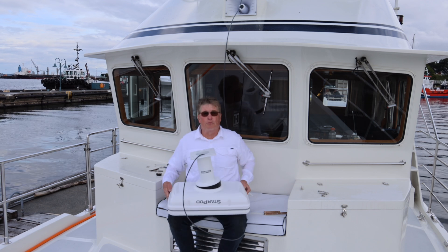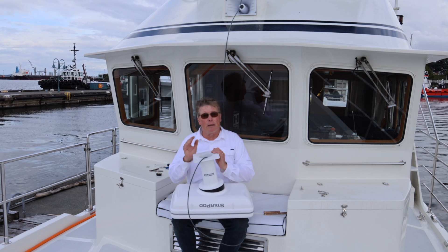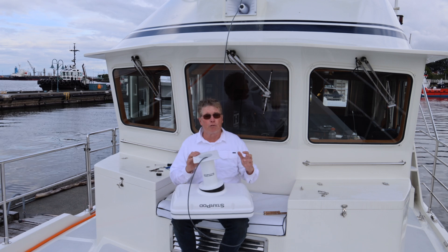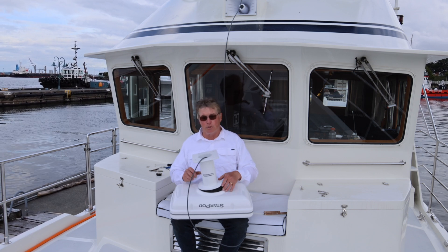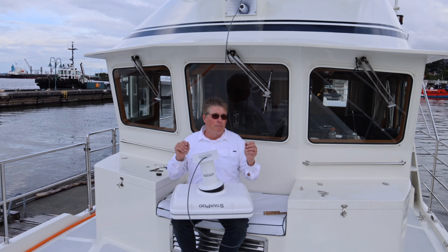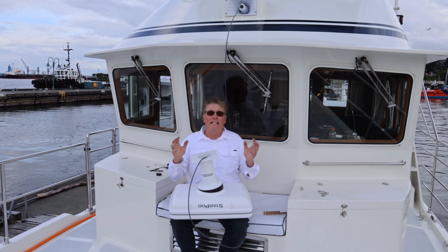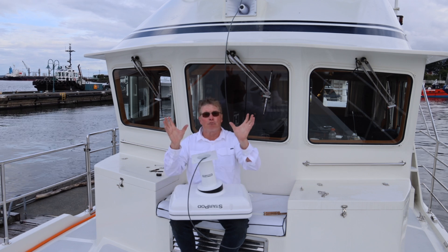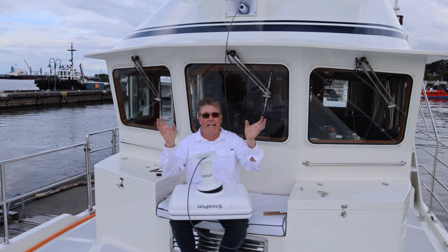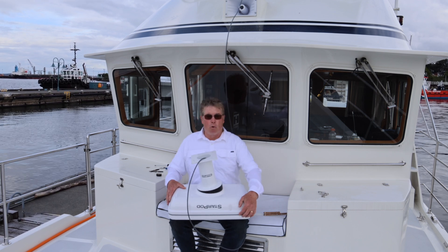Now you can see how that tube itself is straight up. There's enough clearance in there with this 10-degree angle so the tube is straight and it still fits in there. It will go into an obstruction mode when you turn it on. From my experience from over a year of cruising with it — when we obstructed with it, we don't have to break the warranty and drill a hole or dismantle the wires or cut it apart to take the tube out. There's been a lot of boaters with experience eliminating the tube and the actuation. Personally, I think there are so many more satellites now than when this thing came out, when they were searching the sky more. This has a 110-degree viewing angle; the new flat mount one has a 130-degree viewing angle, and they really get a good view of the sky — only getting better with more satellites going up.